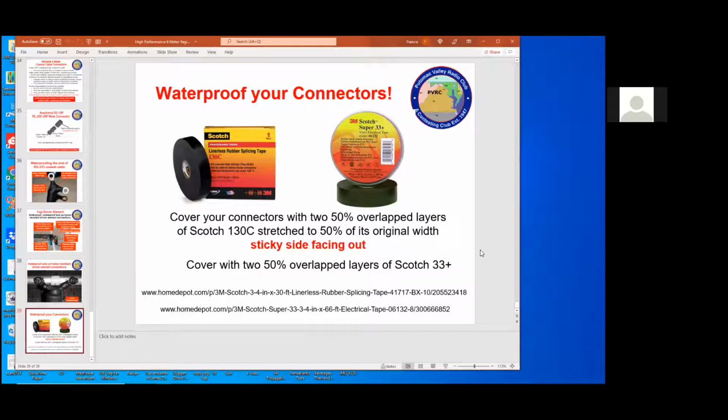And you'll be forced to climb the tower to either replace the stack match or take it out of the circuit. It has protection for that purpose, but again, that can always happen. Yep, the failures happen. Stuff happens. Having protection so you can't hot switch it is a really good idea, but relays will fail over time. Being almost 80 years old, I don't feel like climbing the tower anymore. And it's going to happen at the time when you're most unhappy, like that once in 5 years ZL opening on 6 meters from the East Coast.